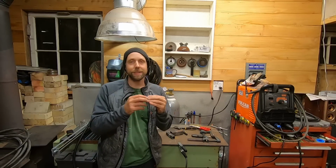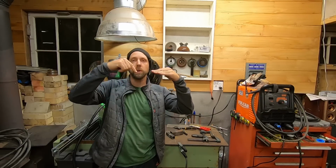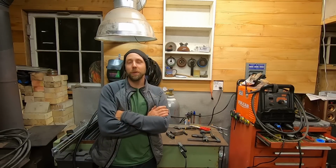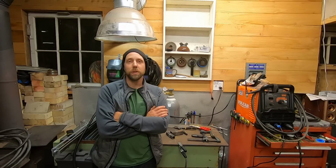You don't want to have a seam or something. You don't want to start and lay another weld right here when it's cold. You want to start in front of it, get the metal hot, move back, and then start filling over that again. Something to consider. These are all techniques that you can apply later on. They're just things to get you thinking about now as you're learning, and just kind of try to implement them here and there, and you'll just start making consistent habits when you're welding.